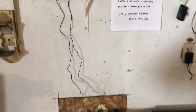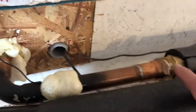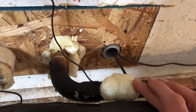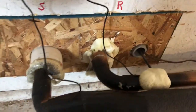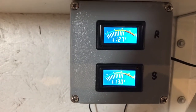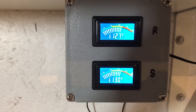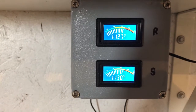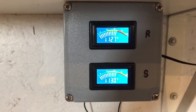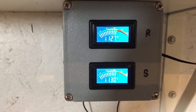I've added some temperature monitoring so we're monitoring supply and return temps — basically right here I have a temperature probe zip-tied underneath this little blob of spray foam. I need to get some more pipe insulation on this one yet. These little digital panel meters read in degrees Fahrenheit; they're off eBay, literally between four and eight dollars a piece depending on whether you get them direct from China or from a US seller. We have supply and return, and I have an almost identical setup over in the boiler shed checking the lines right before they exit the shed and go to the underground lines.